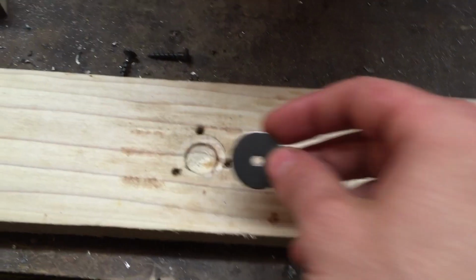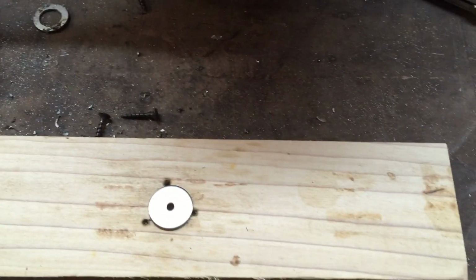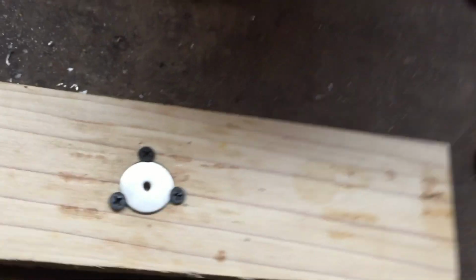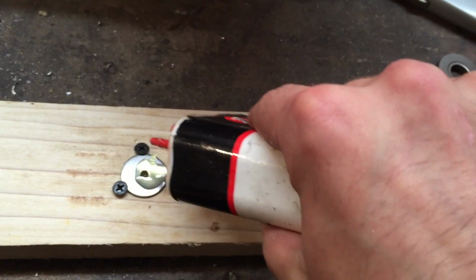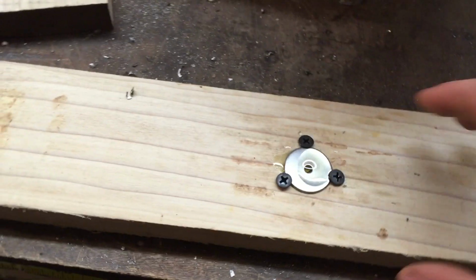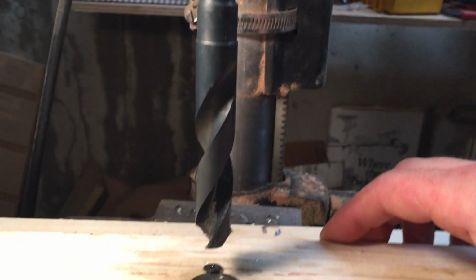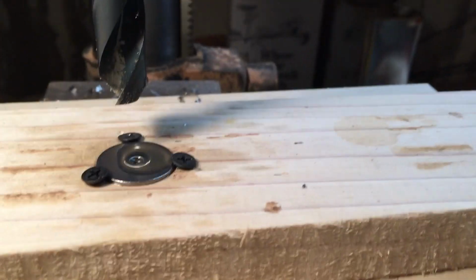So I made this little jig, and I'll show you here. It gets 3 screws, and I promise I didn't make this trick up. I learned this from somewhere, I couldn't tell you where. And get a little bit of your favorite, just any oil. And I got a 5/8 inch drill bit, so that's the size of the arbor. And I got my drill press running at the slowest speed. And let's give her some gas.